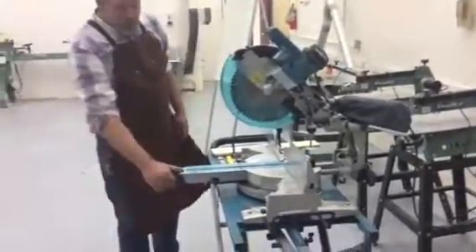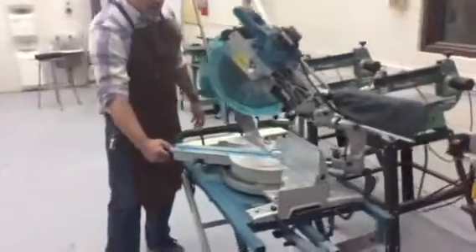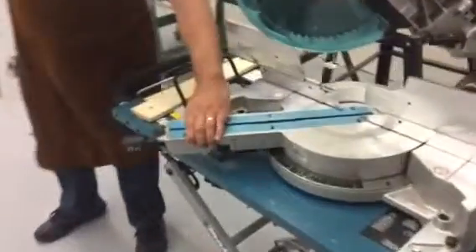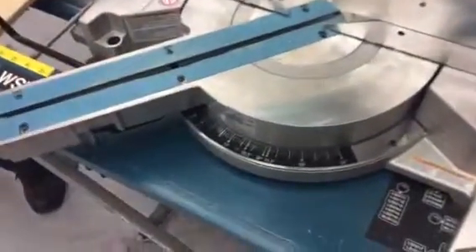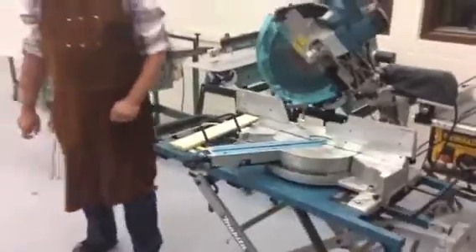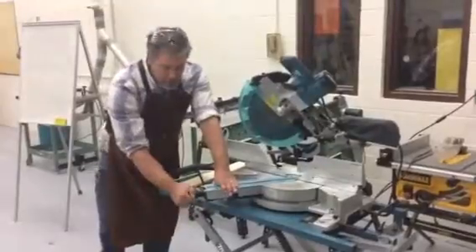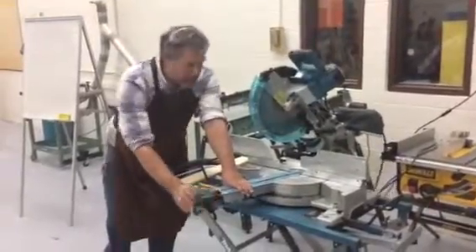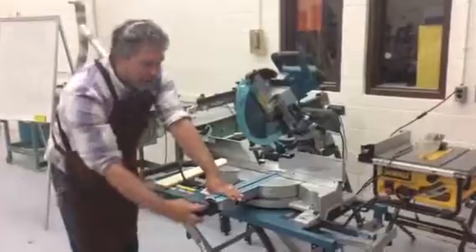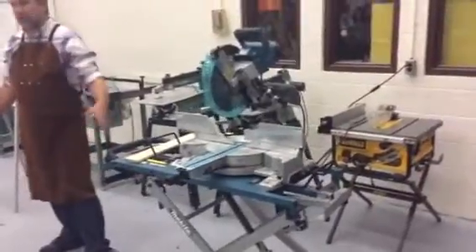You can also change the angle of this blade. You can see that does put a pressure lock on it, but there are also set positions on the machine that lock in. If you're wondering why it won't move, it's probably because it's in a locked position. You've got to turn the handle, push it down, and it pressure locks in most places. But there is also a set lock, and you should release both the set lock and the pressure lock to confirm it's in the right position.